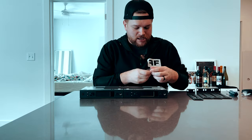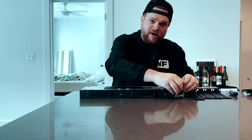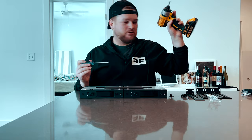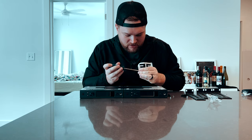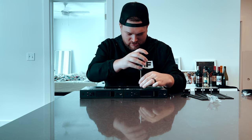Sennheiser sends all kinds of extra parts — like IKEA, you wonder where they're coming from, but at least with Sennheiser you can figure out it's plugs for different countries or for a different unit. I love to drill everything — more power — but on stuff like this you really want to be delicate and use a hand screwdriver, because I don't want to track down more of these little tiny screws. If you strip them, that's just a headache you don't want to deal with. So put the power drill aside and hand-screw these in — it just takes a few extra seconds.